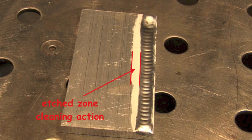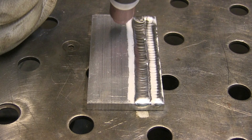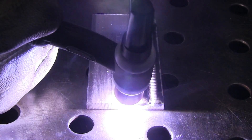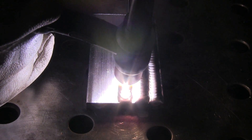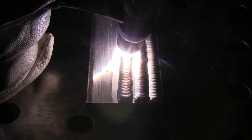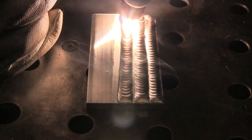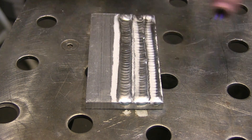For the next bead I'll bump it down five to ten percent. You can see the cleaning has gotten just a little more narrow but there's still a lot of it. False start right there — once the tip balls up on an electrode, if you started with it sharp, the starts usually aren't quite as good; it all depends on the machine. I prefer to have a lot of that frosty area rather than have little black dots — pepper — in the puddle. If I've got pepper in the puddle I'm going to increase the cleaning action, especially if I'm welding aluminum castings or something like that.